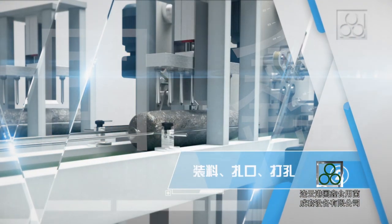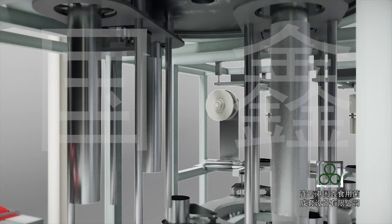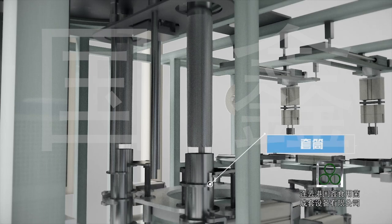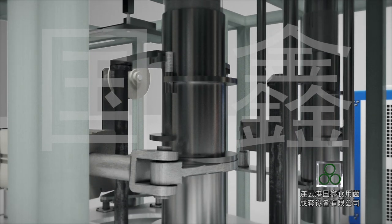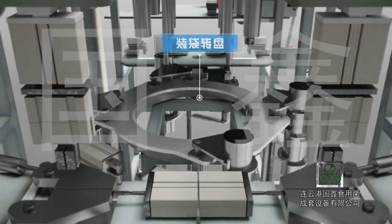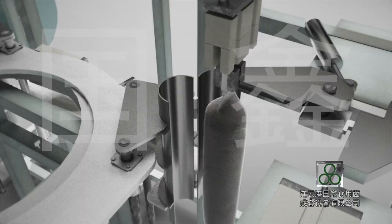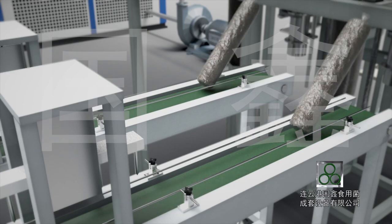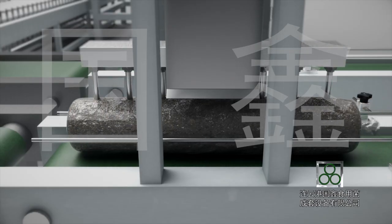Step 2: Substrate filling, bag tying, and punching. The substrate filling pipe rotates to the filling station. The sleeve goes up and wraps around the bags and then the substrate fills into the bags. After that, the filling turntable rotates to the tying station, the sleeve releases automatically, tying the bags, and the substrate logs fall onto the conveyor. The logs are then punched with breathable holes and move to the membrane filming machine.